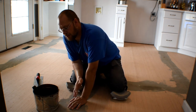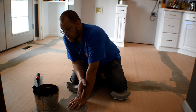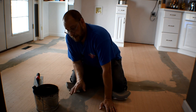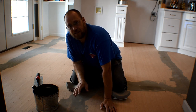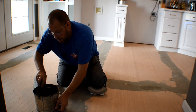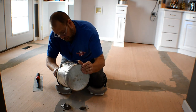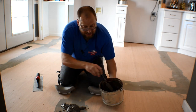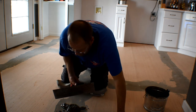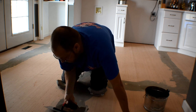Our floor is now scraped, swept, and vacuumed around the walls — again, that's very important. This is going to be our final coat so we want to treat it like it's going to be our final coat and get the floor absolutely clean. Any debris on the edges, around the middle, or anywhere you're going to be working is going to get in your final coat and cause bumps or grooves. This final coat is quite a bit runnier than my first coat, which was pretty thick. This is going to allow for a nice even spread — it's going to work so much smoother because it is thinner and it's going to give an overall smoother finish.